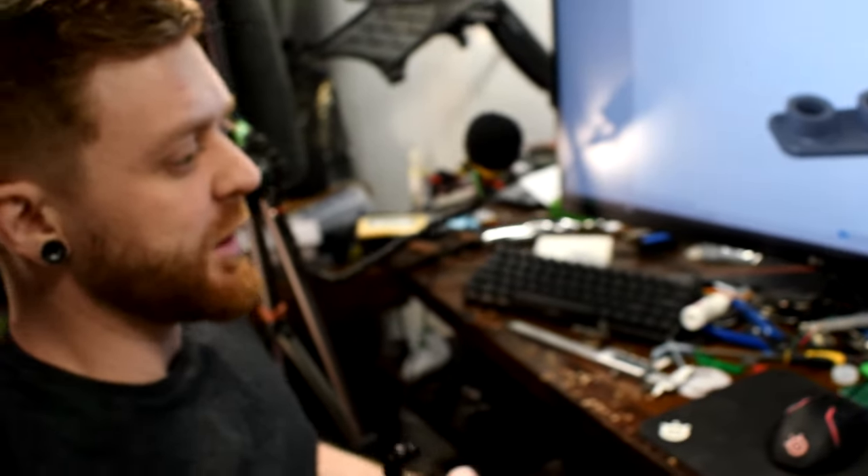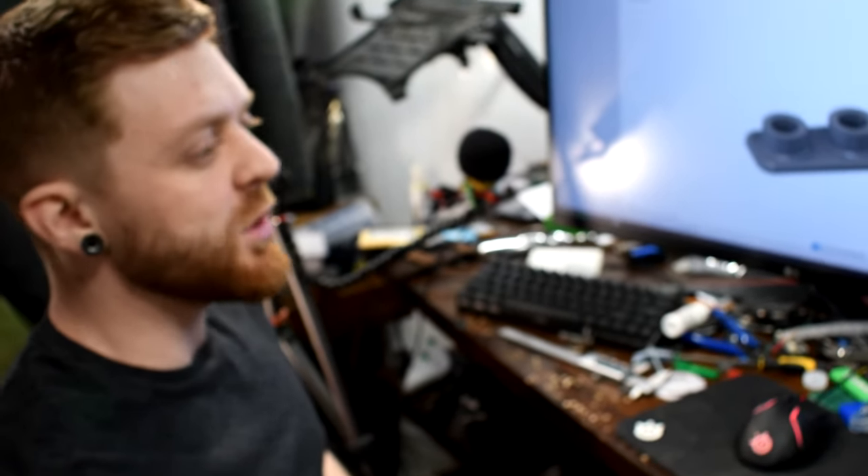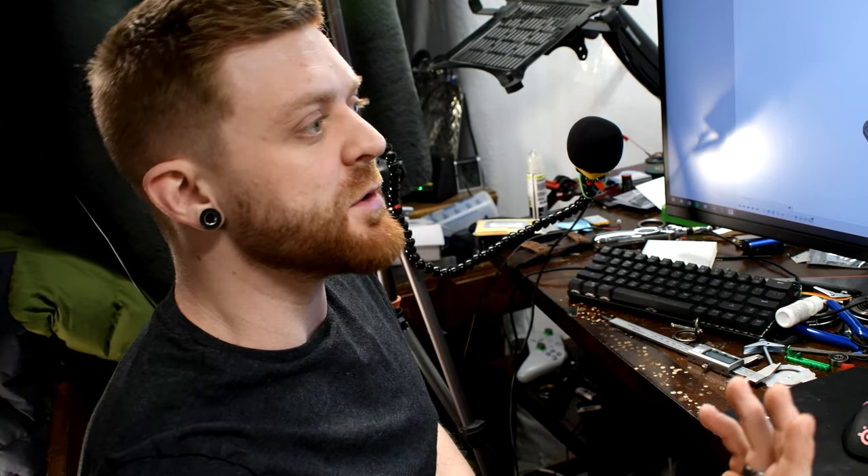This piece came out pretty nice — at least my dimensioning. That's the tricky bit: the printer can do threads, but you're limited somewhat by the tolerance of the nozzle. You can put different size nozzles in and that'll change the amount of extrusion in the software, so you can get higher levels of fidelity. More expensive printers can get high resolution.